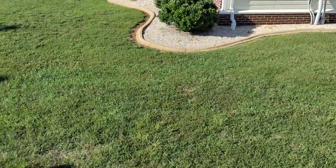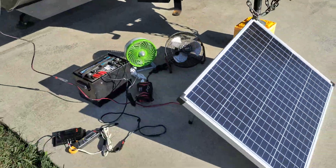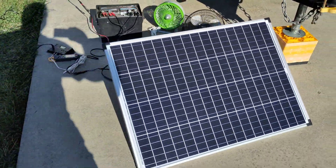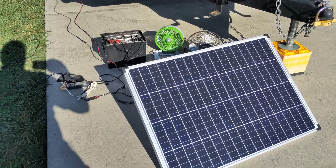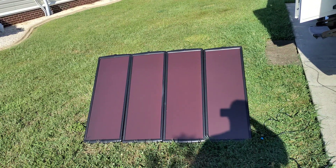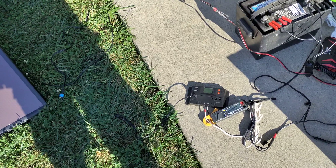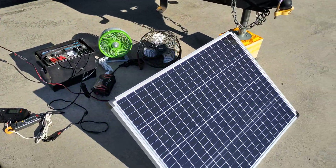I hope this short video clears up some confusion and answers some questions about these two panel kits. The newer monocrystalline panel is definitely more efficient and a smaller size compared to the older amorphous ones — easier to handle, easier to transport, and at least these are stackable so they don't take up a lot of space. This one does not come with a charge controller, but you can pick up a PWM charge controller for 15 to 20 dollars online. Hopefully that answered any questions you may have about these two panel kits — see you next time.